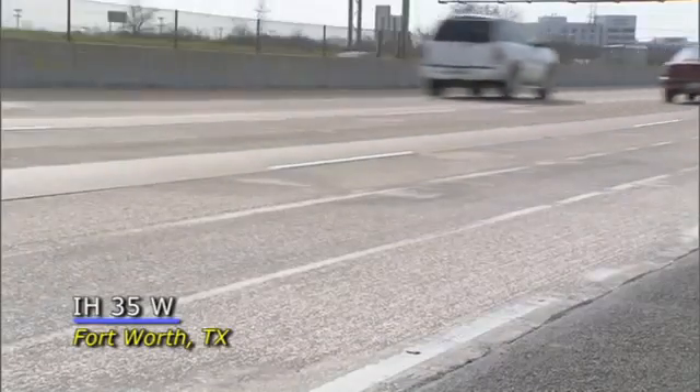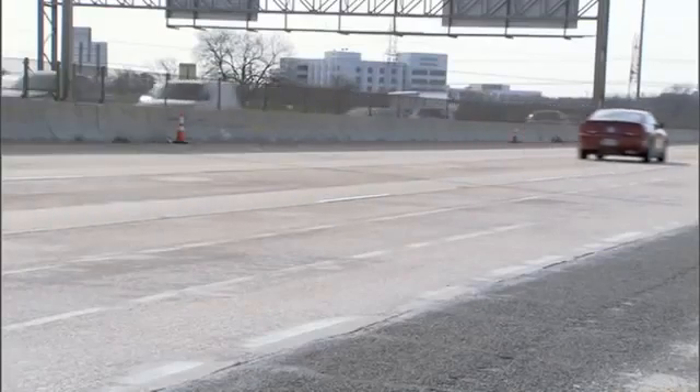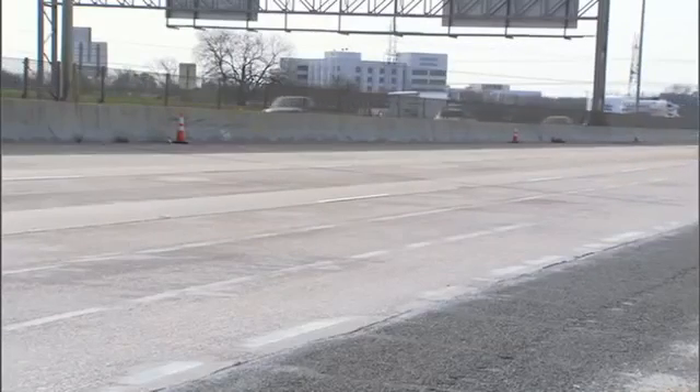The problem was the surface friction, or lack thereof, on the pavement surface, and we're trying to restore and increase that surface friction. What was planned for all of these sections was a thin overlay of hot mix over that concrete pavement. This is pavement in an urban area, so anytime you have an overlay, you're affecting your vertical clearances with any bridges that go over that facility, which we have a few. We don't have that issue with this process, but we do have that potential issue with an overlay.